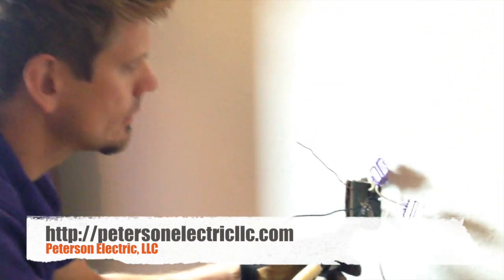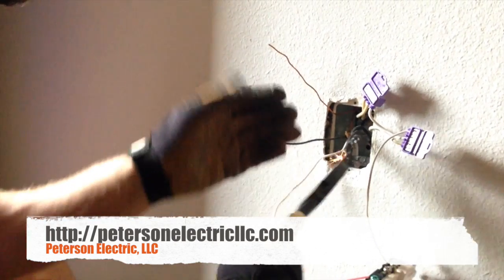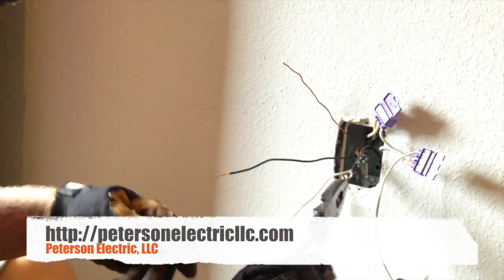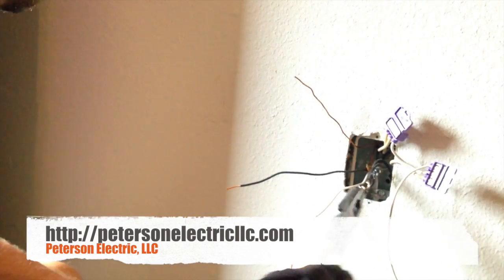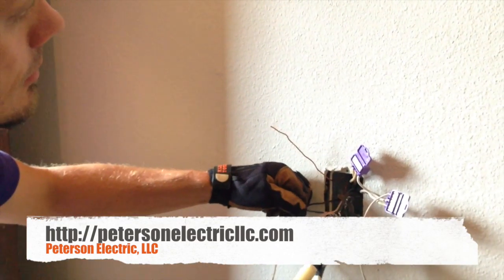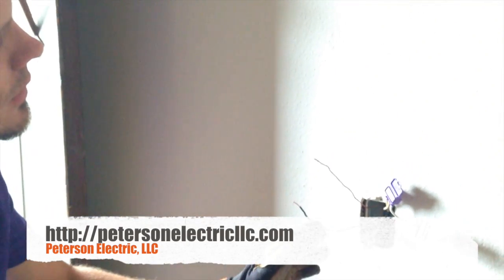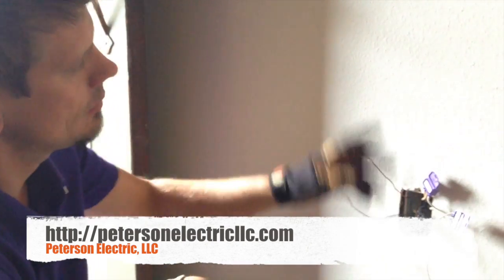What I'd like to show you right here — this wire goes from here to the panel. Look at that, that is just aluminum to aluminum and I'm already starting to get smoke come out. Imagine putting copper on there and having that dissimilar metal reaction, and then imagine putting a load on it — the space heater was right here receiving everybody else's current on its piggyback and then back out to the panel.